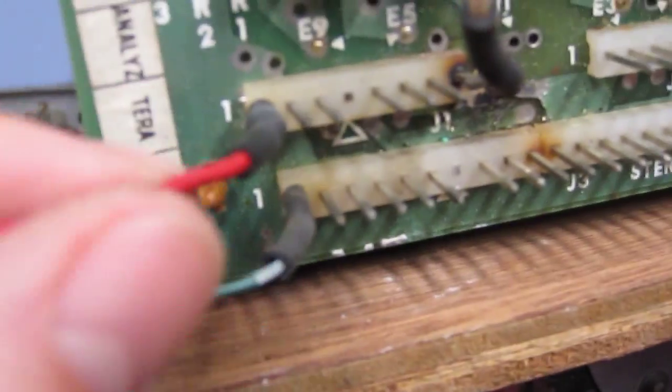We've got some ridiculous 20 amp fuses and things in here that probably shouldn't be in there. We've got wires soldered onto the connectors and cut. We've got burnt connectors. It's not looking great. Oh, there's a wire at the back as well that's been cut. And these things use piddly little bridge rectifiers that probably need replacing with bigger ones. Yeah, look at them little piddly ones. That rectifier board's a bit of a mess. We need to definitely work on that.